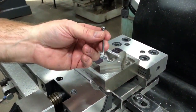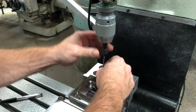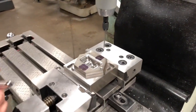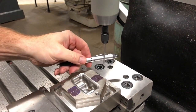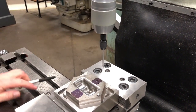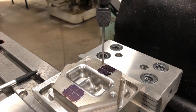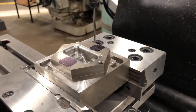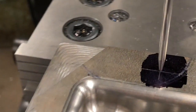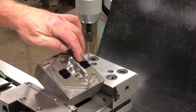I've saved the best — this is the point. I'll put it in and tighten it up a small amount. With this one, I don't actually do anything with it except use it to point. I'll put it off a small amount, turn it on to a thousand RPM, then bring my pencil in so it stops moving. Then I'll use it to locate my X mark here. Now I'm going to turn it off because it's in center — move my X and Y in, bring my Z down, move it around, and voila, I'm on center. The best part of the point is I can pick up a spot on an angle.